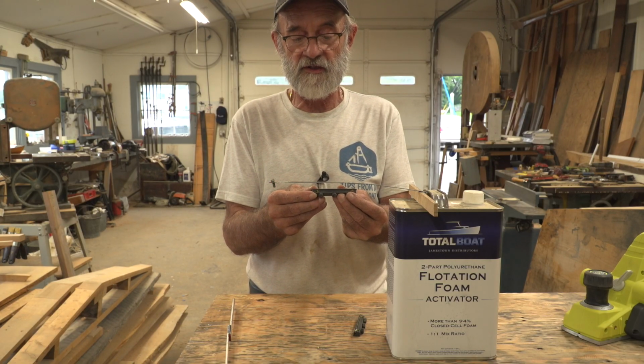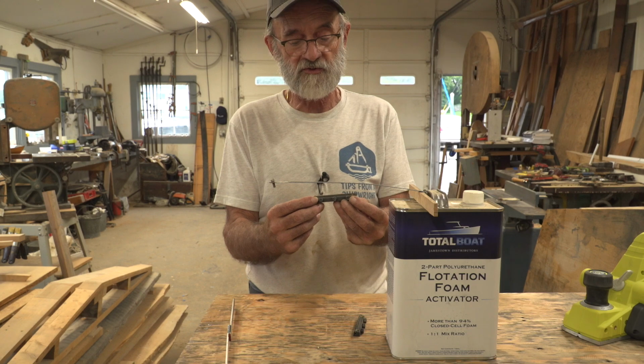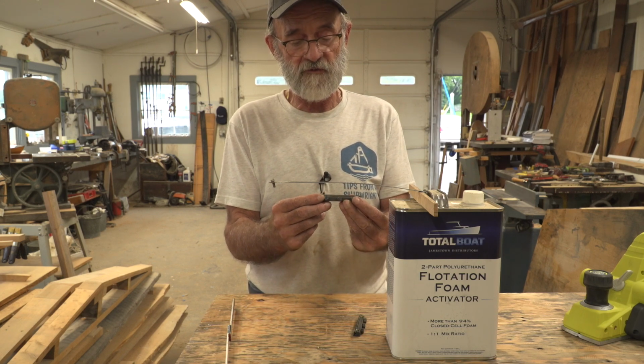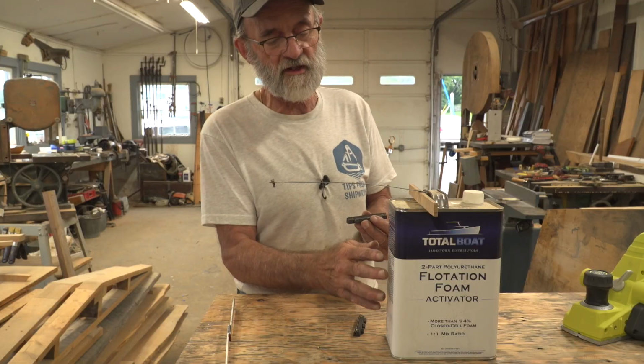The last planer that I used, I had to balance the two pieces, and I used pieces of hacksaw blade behind the pinch bolts. You could also grind the pressure bar in between the pinch bolts or do different other things, but you've got to get them to weigh exactly the same. So what I've done here is I've improvised a little scale here.